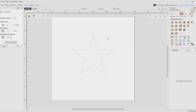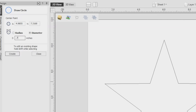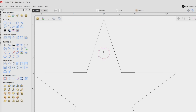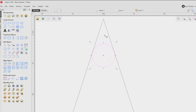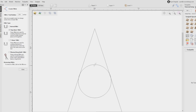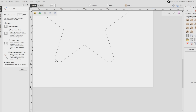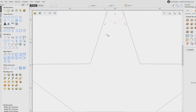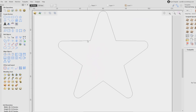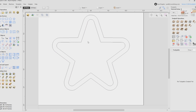We'll be programming a simple star shape. The biggest thing with any bowl and tray bit is that the diameter becomes a factor — it cannot get into very tight corners. So you have to come in with a fillet tool and trim down those edges. Since we're using a three-quarter-inch bit, we'll use a three-eighths radius and fillet all of the outside edges. You do not have to fillet interior edges because the bit can go by and cut on the other side with no problem. Then to make this a tray, do a simple outward offset of a half inch and you have your tray.